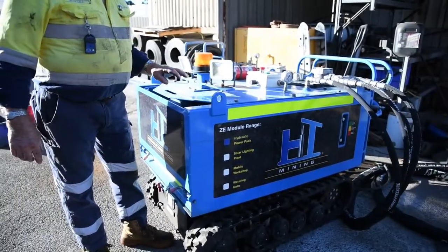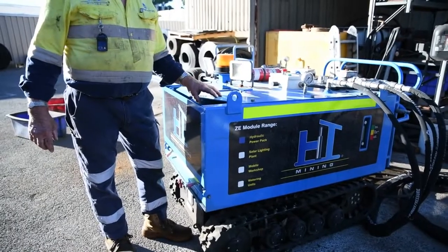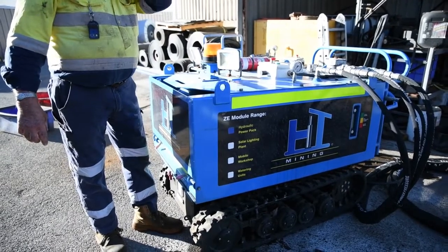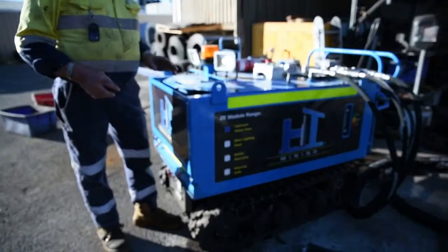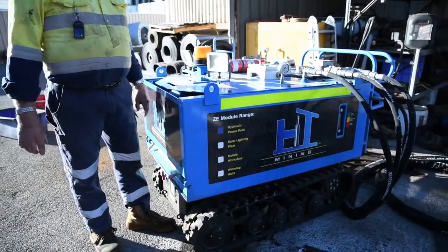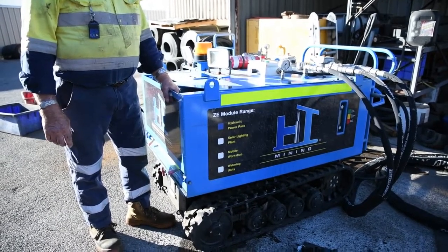The power pack has got an AC motor driving the hydraulics. The hydraulic delivery has to be at least 39 litres a minute, with a capacity of 2,000 PSI. When the drill's not operating it'll go to 2,000 PSI; when it's operating it must run at a pressure between 1,850 and 1,950 PSI. But it must have the 39 litres a minute — anything less and there's just not enough oil to run everything. If it drops to 34 litres you may get a hammer but you definitely won't get rotation, and the hammer will be really weak.